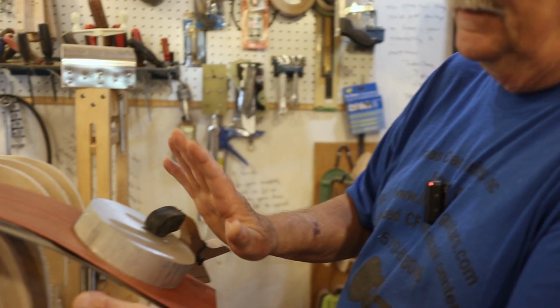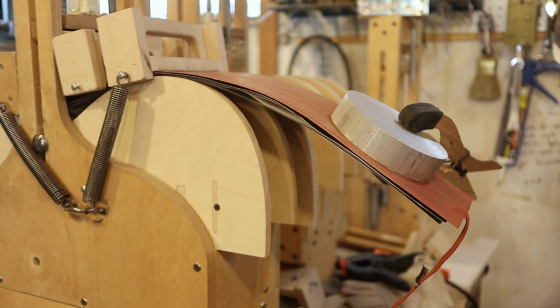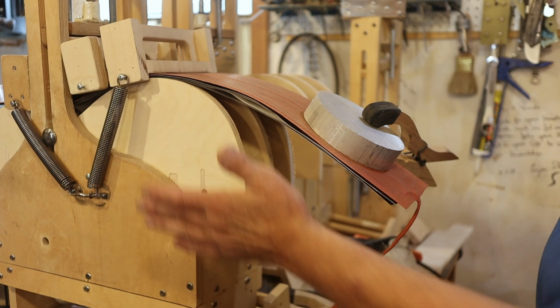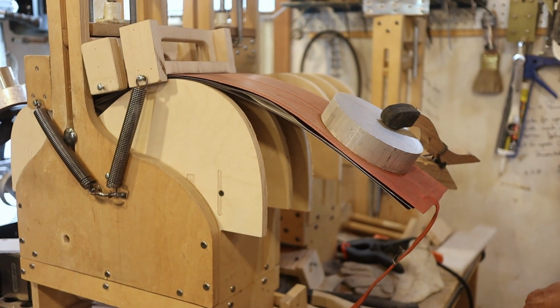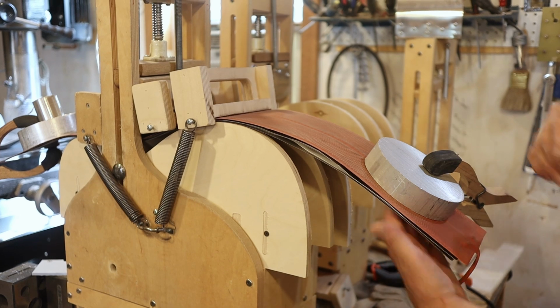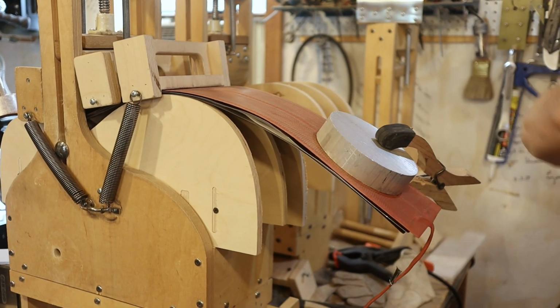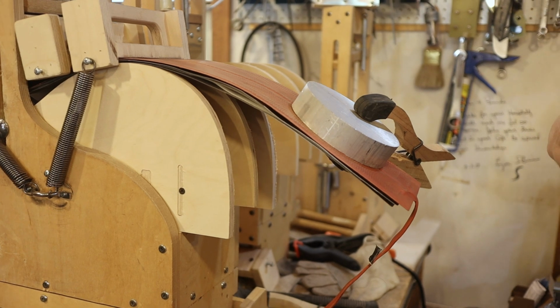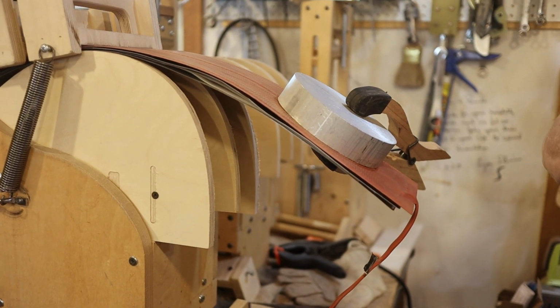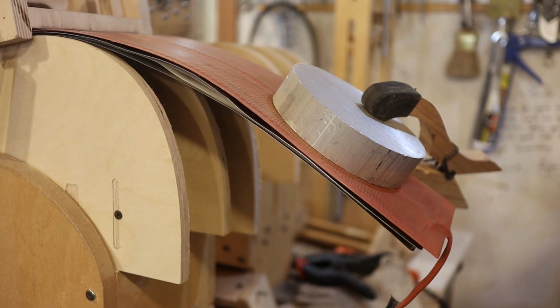And then we have the side sets is 75 thousandths thick. And as you can see, this is a Martin OM shape, also a quad 000. Now the heat's starting to come up here, and I can feel that the heat is starting to come through here. We are now coming into almost 2 minutes. I'm now at 210 degrees.